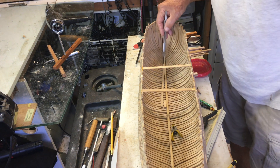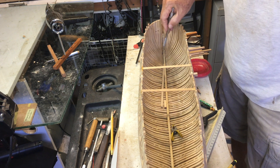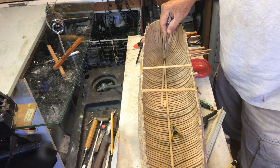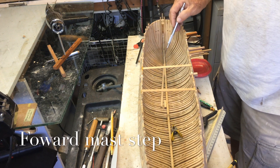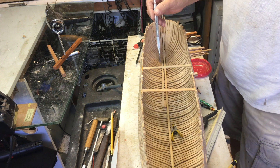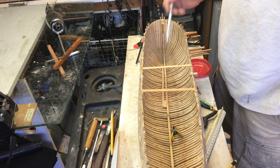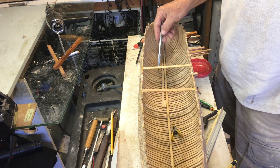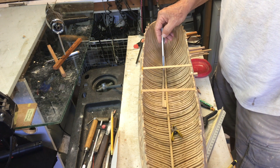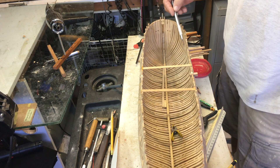The first challenge is where to put the start of the strake. Some have it as high as all the way up here, some have it here, and in Greg's plan it actually disappears under the mast step. Where does the first butt joint take place — here, or as one suggestion suggests, back here? So long as they are approximately on 24-inch centres, we have three planks between each one, and we are consistent that every fourth plank the butt joint is in the same place — that's the key criteria.